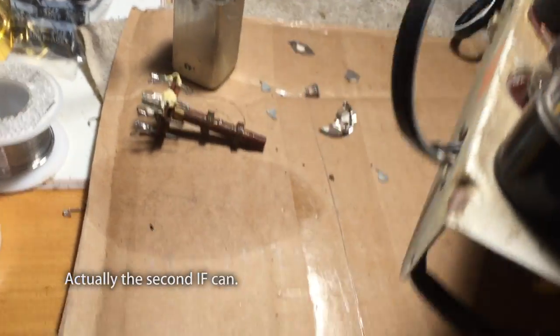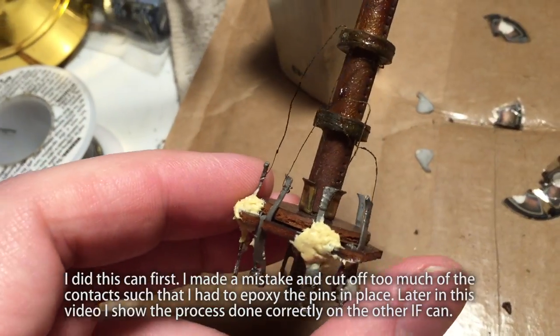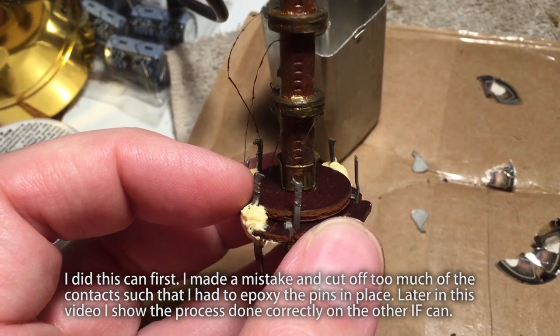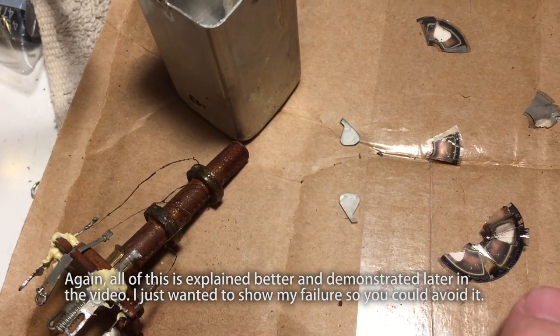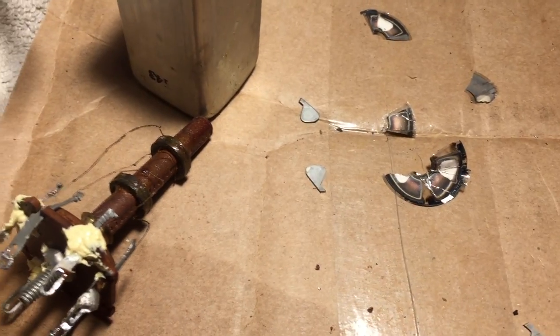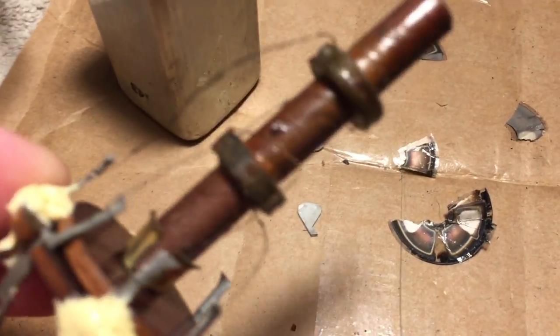So I've got the first IF can here on this small bench. It had silver mica disease, so you take off the nut on the bottom, which opens it up and separates the round phenolic wafer from the bottom. Inside you cut off some of the contacts. This is obviously my first time doing it. I pulled out the mica wafer and destroyed it in the process — I twisted it with tweezers as I pulled it out, but I had no need for it.